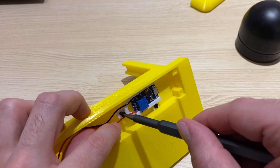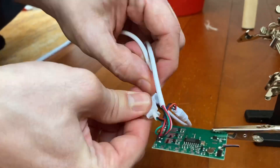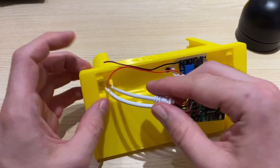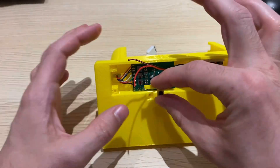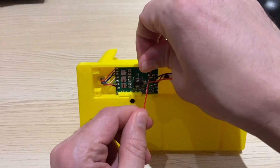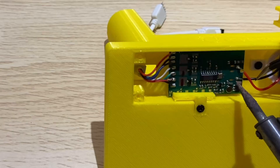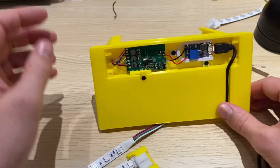Our LED controller has two output cables, but we only have room for one in the enclosure. So I removed the overmold and desoldered the wires to eliminate the second cable. To mount the LED controller, I'll feed the remote sensor and output cable through this hole and mount the PCB in the bottom of the box using a bracket that clamps down on the PCB with an M3x5 screw. Then we just connect the positive and negative wires from the DC converter to the LED controller — cut, strip, and solder. Finally, I've added the power input cable using a micro USB cable.